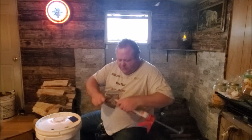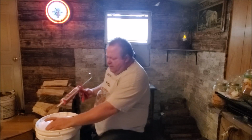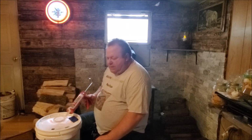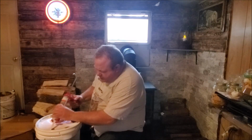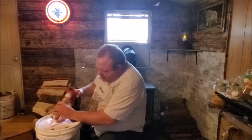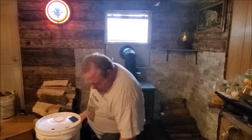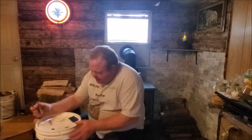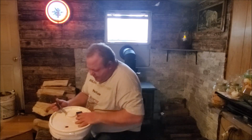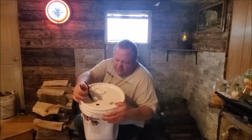I resealed this with a deck screw. Now, the first one I did, I put a big bubble on here of sealer. And then I said, well, that just makes it going to catch easier and come and rip off. So here's what I come up with now. I'm just going to put a bead, maybe 2 inches long across there, if you can see that. These pliers probably show better on camera with contrast. They're old. My bead starts here. I don't know if you can see it. Tip it up here. My bead starts here and ends here.